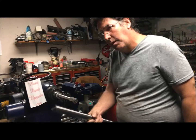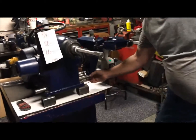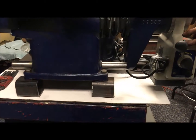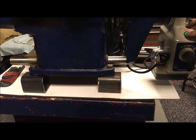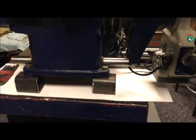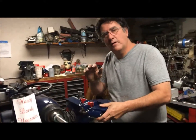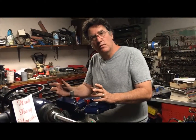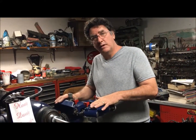recommending that everybody change their guide bar for a brand new guide bar and attach the guide bar directly to the crossfeed carriage and lock it down so that the guide bar slides with the carriage like this. Okay, that right there improves cutter head stability tremendously. This makes a huge difference if you're cutting larger rotors like the Hellcat rotors or the Transit van rotors. These 13 and 14-inch rotors, you really need a more stable cutter head.